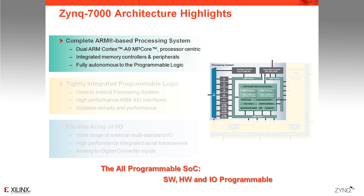As you have seen in the hardware architecture introduction, the processing system of the Zynq 7000 devices is a complete system that contains all that is needed to run most existing operating systems out of the box without requiring any programmable logic design to be done. It is a processor-centric approach, which means that at power-on, the processor boots first and decides what happens with the programmable logic. That basically means that you can connect it to your standard software development tools right at power-on and get your software development ongoing prior to the hardware being designed.